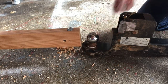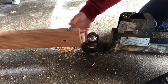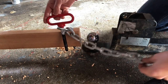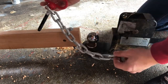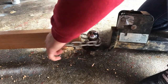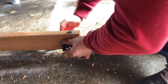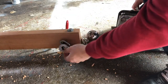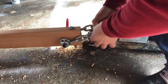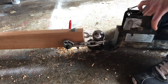I mocked up the hitch connection to the back of my ATV. I drilled a hole through the reinforced tongue tip and got a hitch pin and 14 inches of 5/16-inch galvanized chain — which was very cheap — to loop around the trailer ball on the ATV. A 20-cent washer keeps it from walking off, clip goes on, loops around the ball, and you're in business pulling.